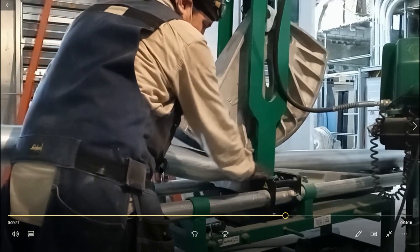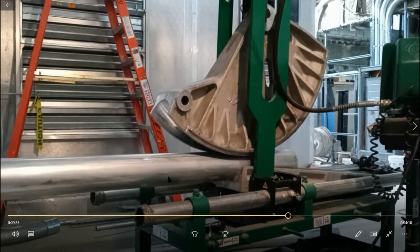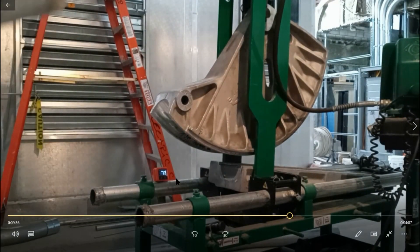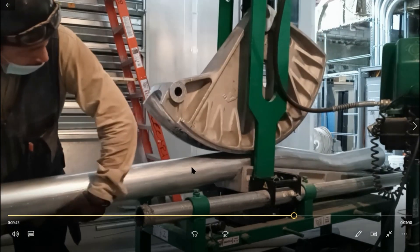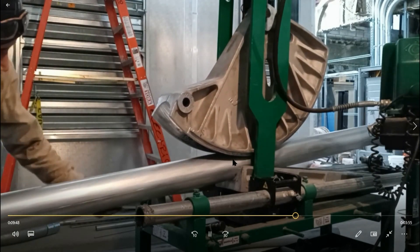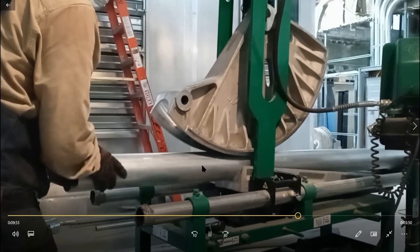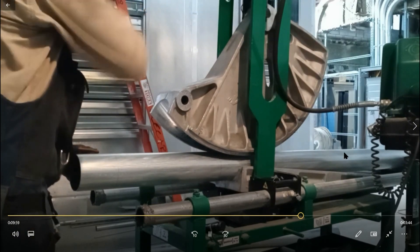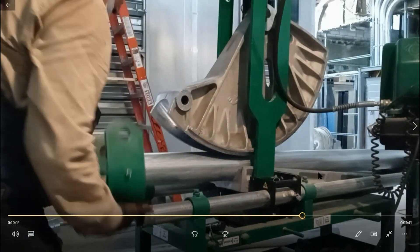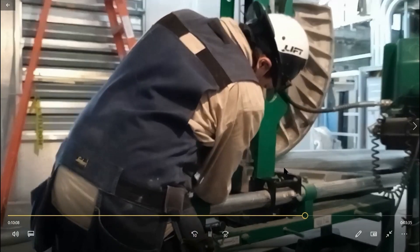I released it — I already finished my offset. By the way, I was doing a four-inch offset at 10 degrees, and my spacing was 23 inches in between bends. A guy walked by and asked if I was doing a four-point saddle — it looked pretty cool — but no, I just didn't want to waste the pipe. I did two offsets on one pipe and ended up cutting it at 50 inches on both sides. I only lost about a half inch of shrink, so I didn't really lose anything.